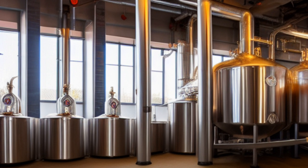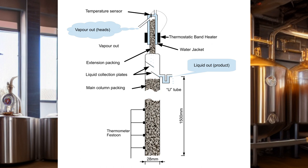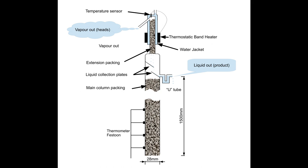There are several parameters that can control the quality of multiply distilled vodkas. One option is to run one or more of the distillations to a concentration below the azeotrope, which would be rather similar to a stripping run followed by a spirit run in a pot still. I haven't done that with my continuous still, but what I have done is experiment with another parameter, the temperature of the column extension. The higher this temperature is, the more volatile chemicals will be partitioned into the heads and not the product, but also the more ethanol will be lost to the heads. You do have the option of recycling the heads through the still in subsequent first distillation runs, but I generally wouldn't do that with the heads from a first distillation run done with a relatively low column extension temperature.